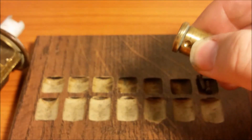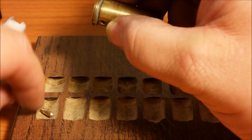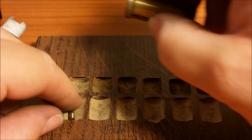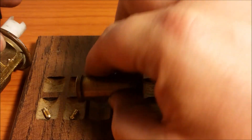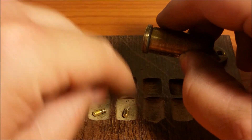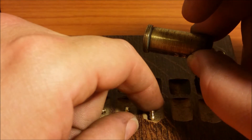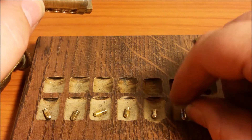Let's go ahead and look at these pins. Chamber one is a single deep serration with a sharp top. Chamber two is three serrations. Chamber three is two serrations. Chamber four is an inverted T-pin. Chamber five is a spool, and chamber six has about five serrations on it.